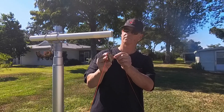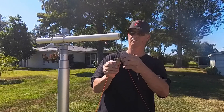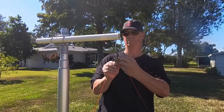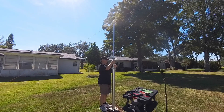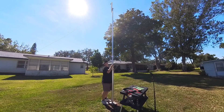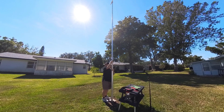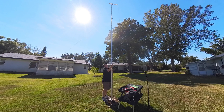On your first go, stretch out that wire across the ground before you attach the terminal to the matching transformer — it just works better. Then once you wind it up on a winder in the future, you can start at the transformer and work your way back. I'm going to extend the PortaMast all the way up to get a better idea of exactly where I want to tie down the wires, and that'll tell me where to put stakes in the ground to take out the slack.